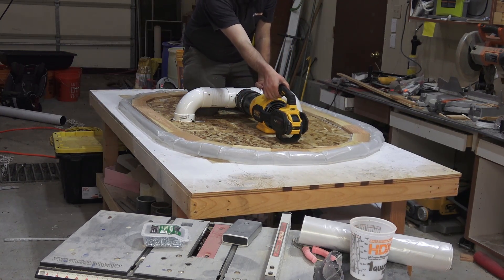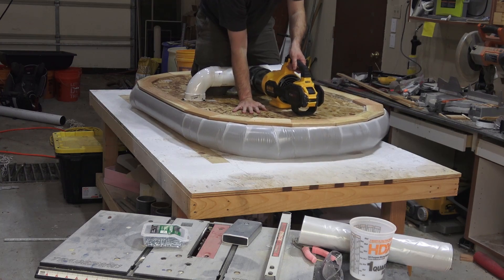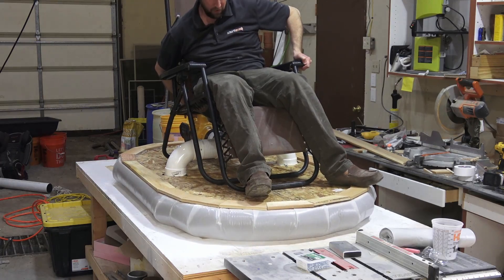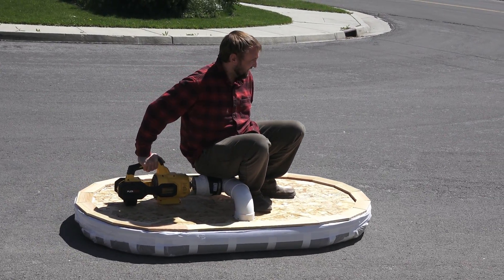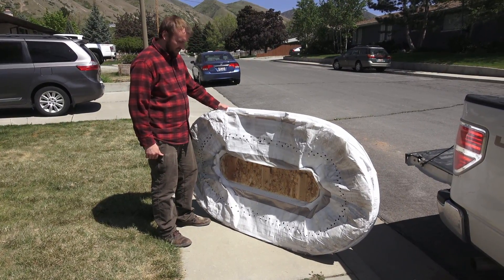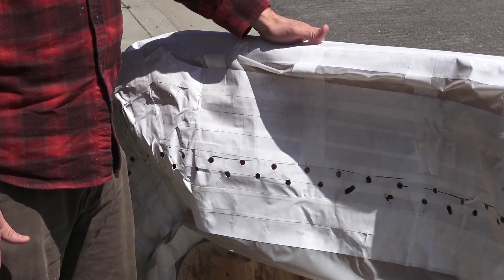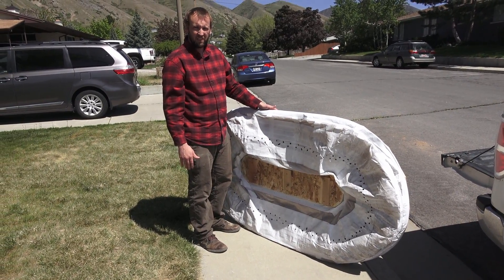Okay, I'm just going to stay on my knees right here. Yeah, it hovers — I almost went off the table! It doesn't work super great though. You can see there's a lot of friction on the front where it gets dirty, not very much on the back, and there's too much air coming out the side. I probably should have made it round. My fan is just barely not powerful enough to make it work really well, but we're going to try in a few flatter, smoother spots than just the street — it might work better.